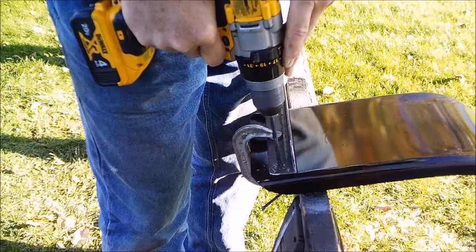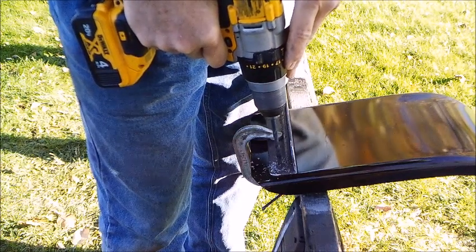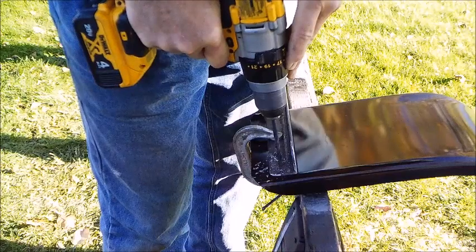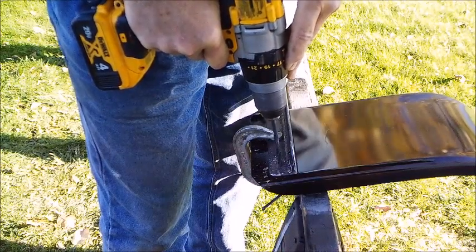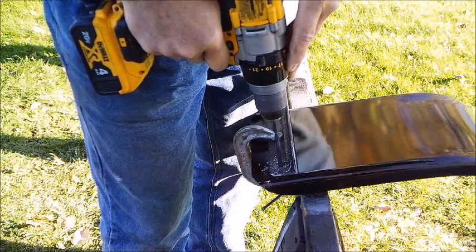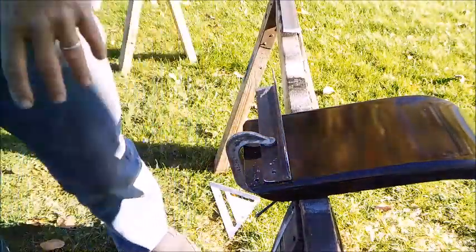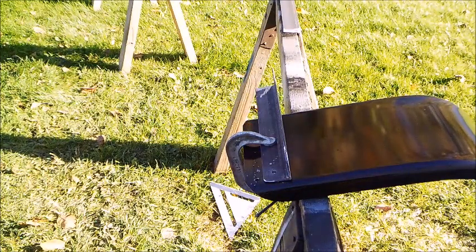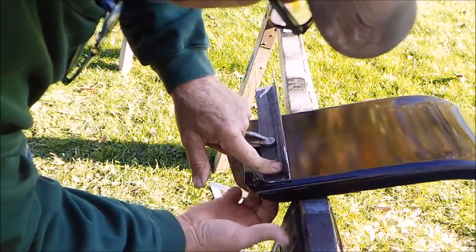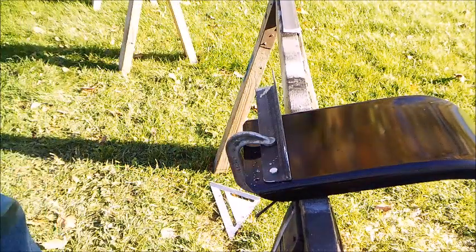Oh yeah, she's nice and sharp. Never drill too fast. You'll burn your bits right up. You want to see those nice coils of metal coming off. That keeps the cutting lips of the drill bit cool because you're cutting into the fresh metal. I knew it was coming to the end, that's why I sped it up, so it would not kick and twist my wrist. Throw that guy on there to locate it. This temporarily. You're getting the gist, aren't you?